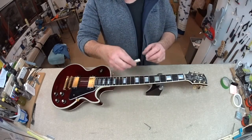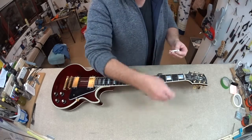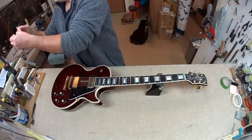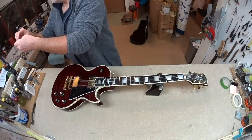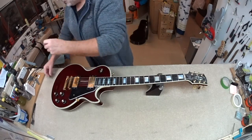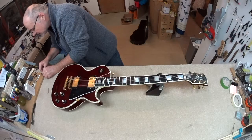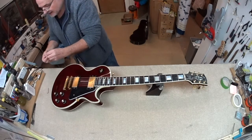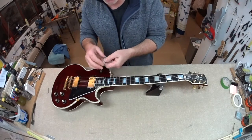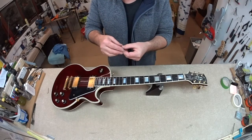In the meantime, Graph Tech saw an opportunity and very smartly came out with this little adjustable nut insert — you can see I'm winding it up on grub screws. That's the little insert, and it was designed to drop into the existing Gibson brass space. You just drop this insert in there and it will take the place of the notchy thing. Interestingly, it also puts it back to being a slotted nut, which they'd gone away from by using the zero fret.